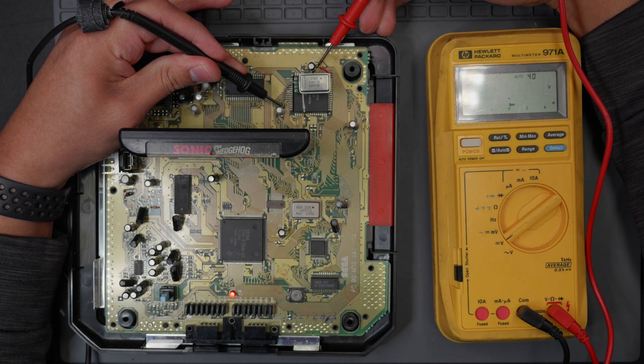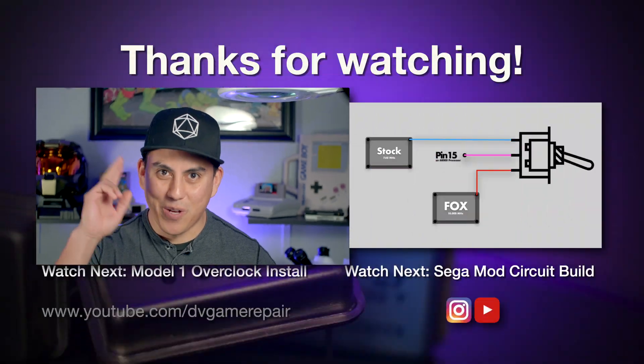I really am going to dive a little bit deeper into how people were able to achieve higher clock speeds than I was. Off the top of my head, I was thinking that maybe my oscillators weren't 5V or I wasn't getting proper voltage to them. This was quickly put to rest by checking the spec sheets on each oscillator and confirming they were 5V, as well as testing power while the games were running. All in all, my pursuit for the ultimate overclocked Genesis continues — you can bet it's not over. Keep posted on my channel for more mods and repairs, and remember, a like and subscribe is always appreciated. Thank you again for your support and we will catch you guys later.